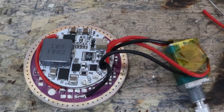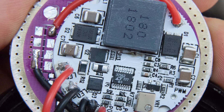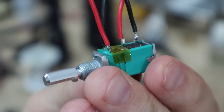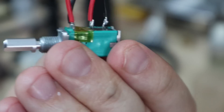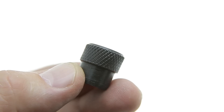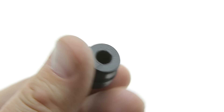Once that was done, I decided to install the TASC LED driver. I basically just removed the components off the old BLF GT driver and made a flat surface to stick the new driver to. This board doesn't have a user interface of its own, so you have to use a potentiometer to control the power. I got a 50k pot with a push-button switch and made my own button because the rod from the pot wasn't long enough otherwise.